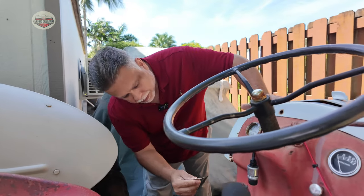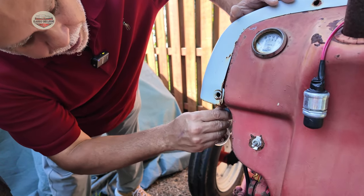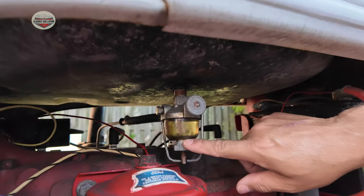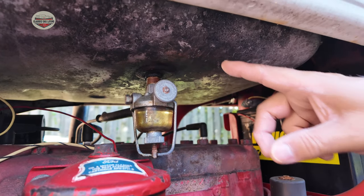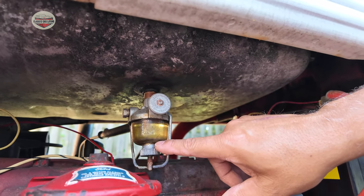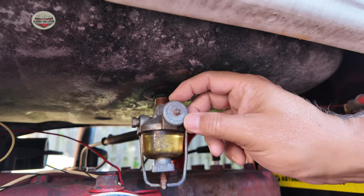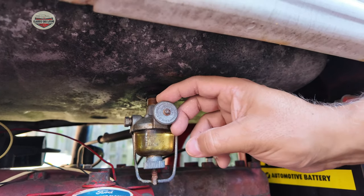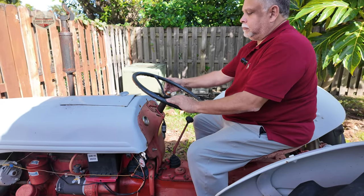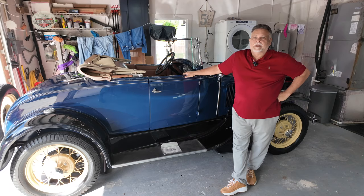You put it in the ignition and just turn it — it's not going to actually start the tractor. This is very similar to what's in the Model A. It's a gravity-fed filter for the fuel system. You always have to shut it off when you're not using it. What I usually like to do is turn it two full turns to get the fuel going, and then you press... Wow, tell me how many cars start that quickly! Why a tractor? It has the same, or a very similar, engine as the Model A.